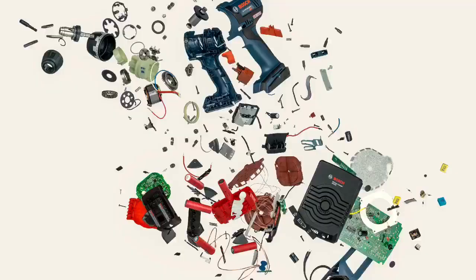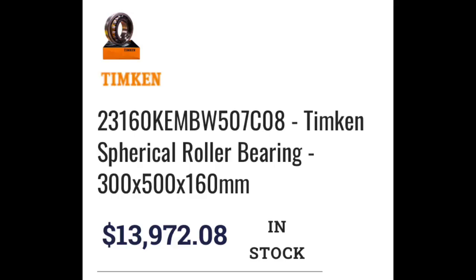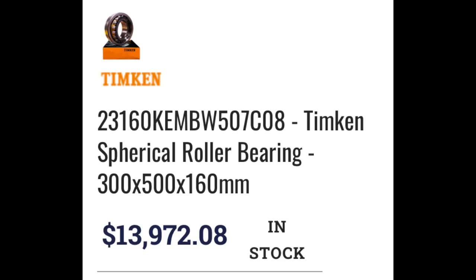For this one there's an old saying: if it isn't broke, don't fix it. When you're dealing with these universal motors and brushes, you see guys yanking out everything — pulling out bearings and replacing them. Sometimes you're better off leaving the old bearings, especially old USA-made bearings like Timken bearings. They're super high quality. You think you're doing right by swapping in a new Chinese-made bearing, but a lot of those bearings aren't up to snuff.